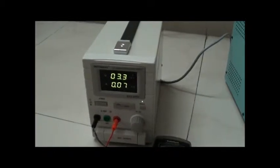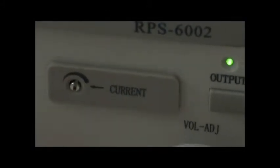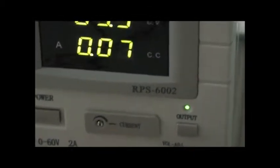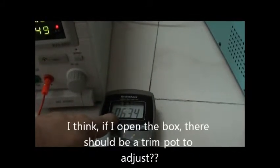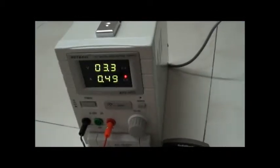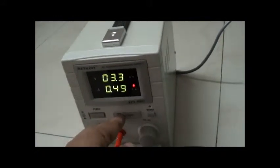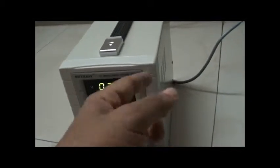One feature of this power supply is the current setting — it's not very easy to change. You have to use a screwdriver to change the current setting, which is good in some sense because you cannot accidentally change the current limit. It also has an output switch. If you click the output off, the voltage basically goes to 0, although it actually goes to about negative 0.6 volts, which may not be ideal. When the output is off, you can set the current limit using the small potentiometer with a screwdriver. Right now I have set it to about 0.5 amps.